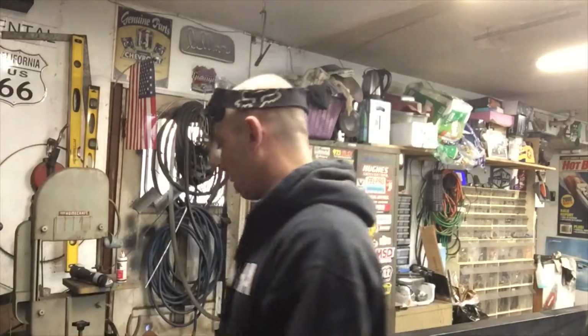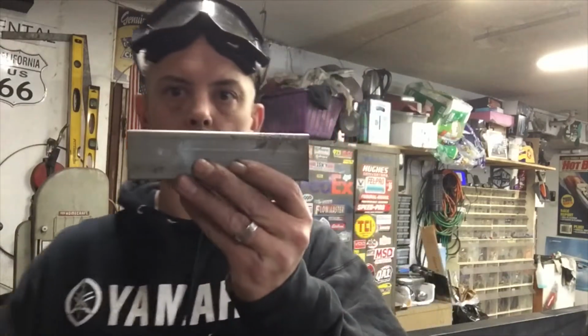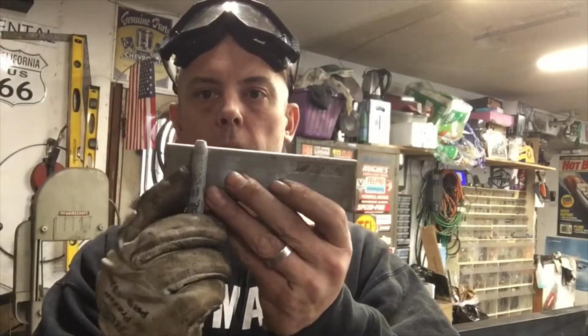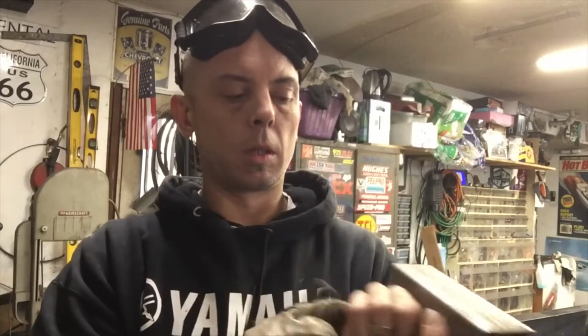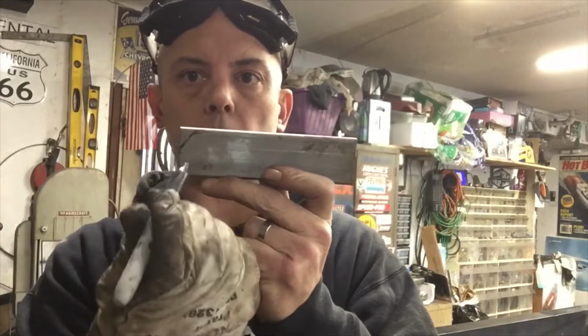Unfortunately, first mount idea, not so excited about it. Don't think it's gonna have enough strength to get what we want done. So I think what we're gonna do is probably leave it in a box shape. We'll put a sleeve through it with an Allen head bolt. So that way it'll be kind of reinforced for the top and the bottom. And then we'll just kind of take and round that edge a little bit right there.